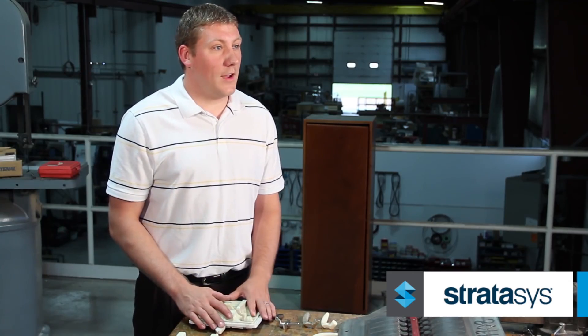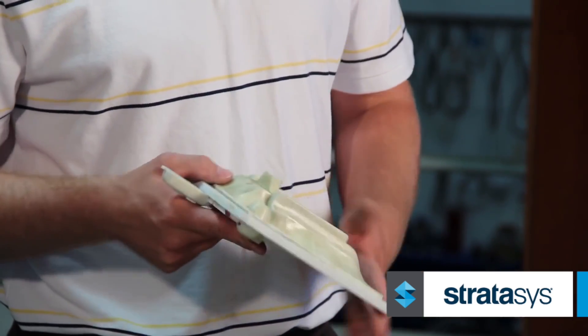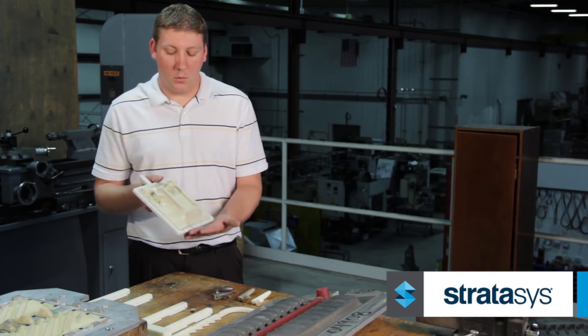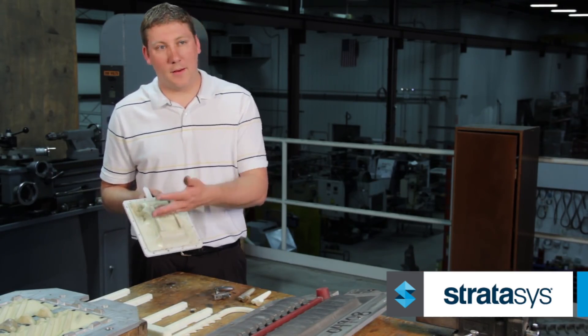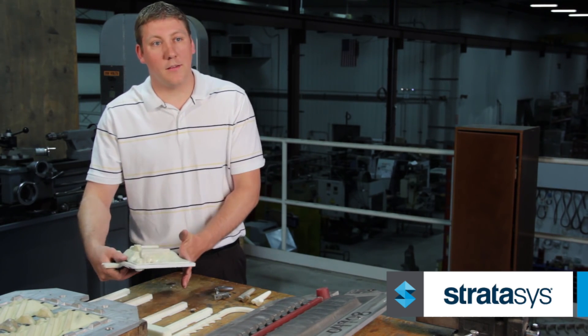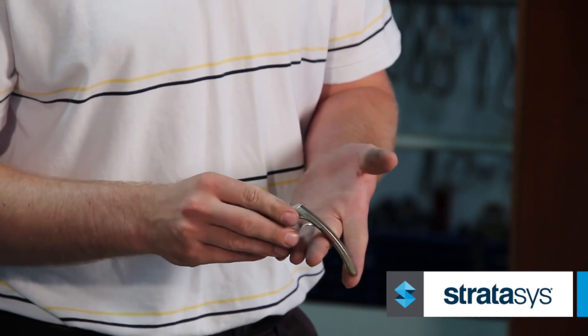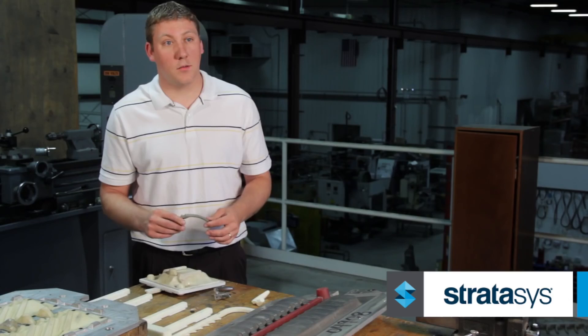This is our pattern shop. Once the rapid prototype is approved by the customer, what we'll do is a mini insert on a pattern — so we're not doing full production tooling. We will actually throw in this instance a left and right handle on a mini pattern, mount that into a match plate, which we will then cast to get actual physical cast samples of the part to then send to the customer for approval.